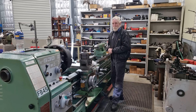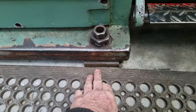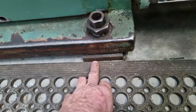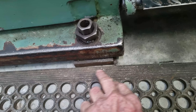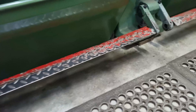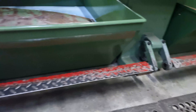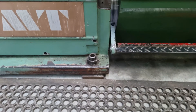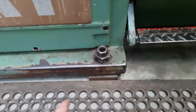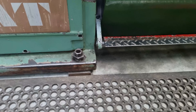So we'll show you our plan. My preferred method for feet as far as machines go is to keep them low to the ground. I use 20mm plate — three-quarter plate — 100mm, 4 inches long by 3 inches, 75mm wide. I have these under all of the jacking bolts on the machine and a couple down there as well. I don't like using big round pucks and I don't like things sticking out, so that's why I use square or oblong shaped feet.